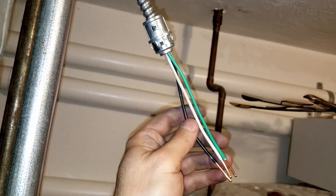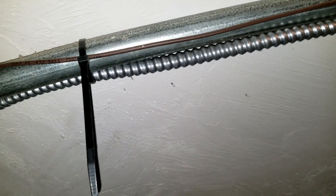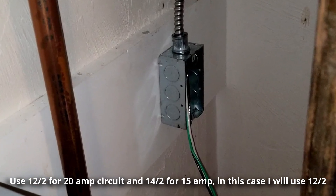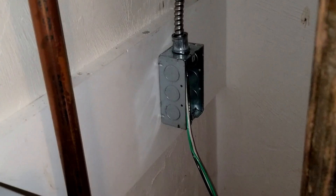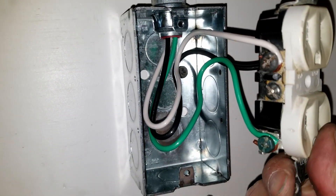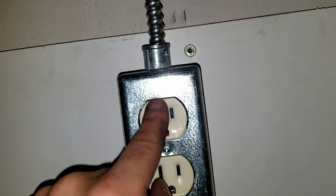Now that the wires are cut and stripped, we're going to tie into the junction box. The MC cable is exposed, held in place with wire ties and clamps, running from the junction box to the outlet box where the water heater will plug in. Make sure you use the right cable — 12-2 for a 20 amp circuit and 14-2 for a 15 amp circuit. Before doing any work, turn your breaker off. On the outlet end, the white wire goes to the lightest screw, the black wire goes to the copper screw, and the ground goes to the ground screw.